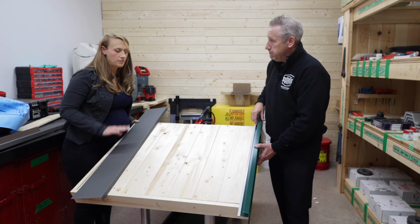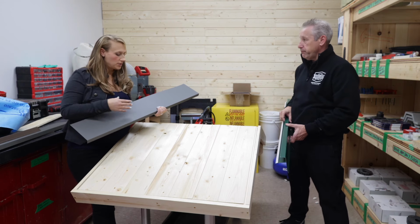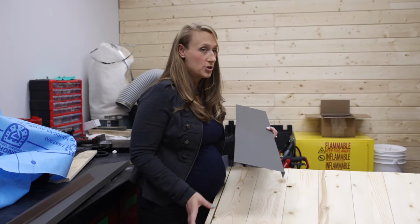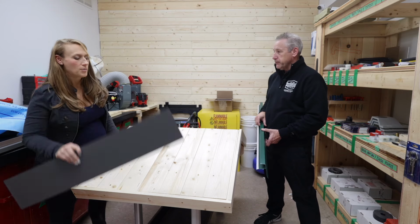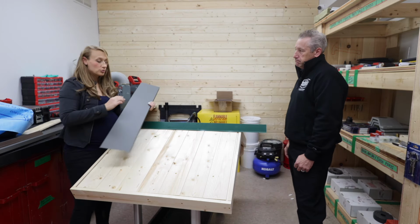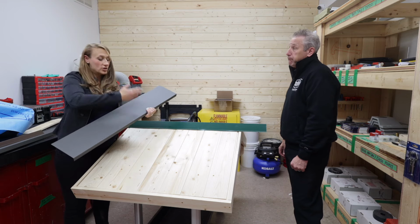Yeah. So let's just recap for everyone. Basically, the optional fascia piece, you would work with the metal supplier to order the depth of this, based on your strapping and how much you've built out the roof. Again, it's optional, but it is nice. It can go on both the eave ends and on the gable ends. And then your actual flying gable starter and your gable starter will go over top of this.